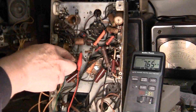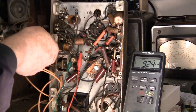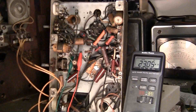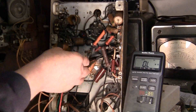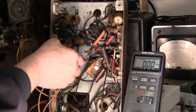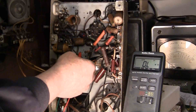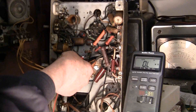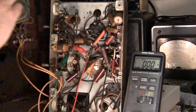I'm thinking this paper cap might be leaking. Since all the coils are good, let's cut this and see what happens. There it is! There's our coil, and there's no leakage between coils anymore. So we got a bad cap, which is not a surprise to anybody.